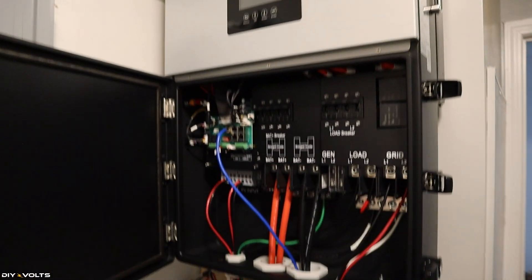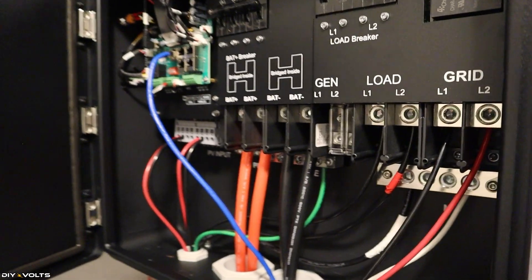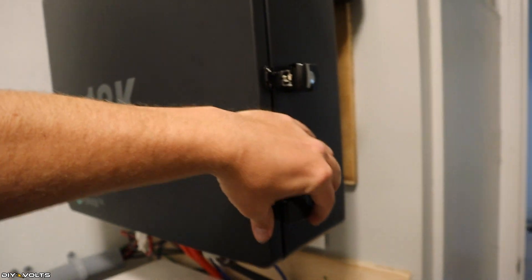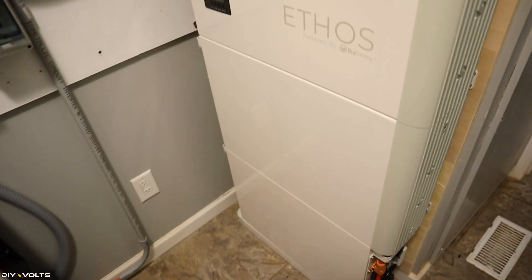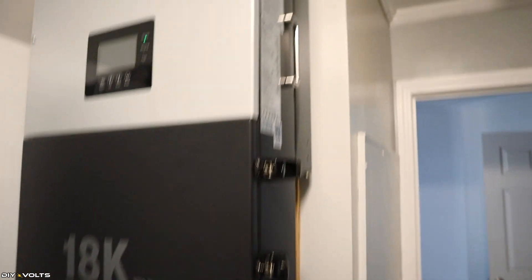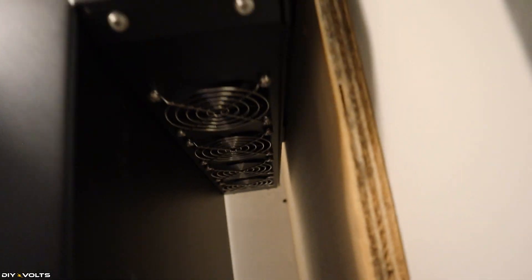I have everything wired up in here — it's very straightforward and easy to work with. In the future I will be adding one more string of solar, and that will get this thing up to 9,000 watts, which is pretty amazing. I'm also going to do another video where I install an additional Ethos big battery — that should give me 20k of battery storage. That concludes the install of this inverter. It is a heavy beast, but listen to how quiet it is. The fans don't kick on until you have around 5,000 or 6,000 watts coming out.